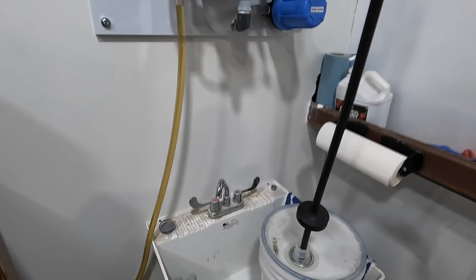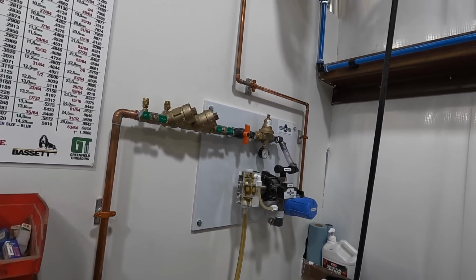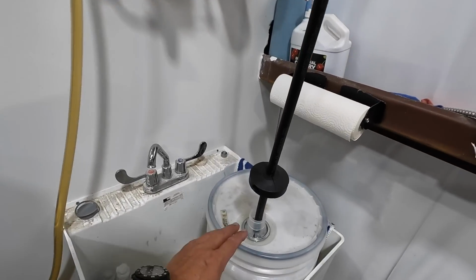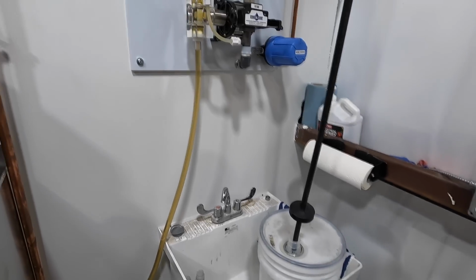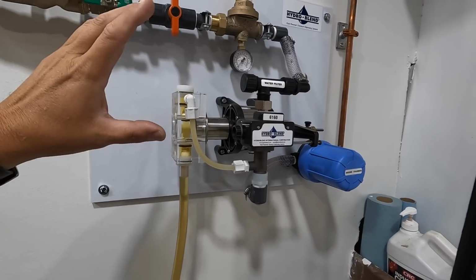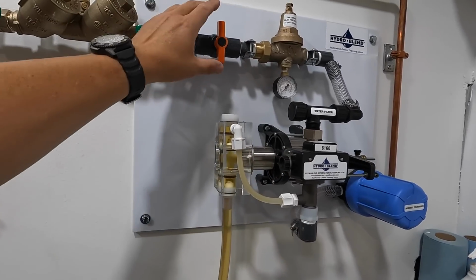And then I've got a refractometer that we're using to test it. What we're shooting for is right at a 10% mixture in the machine. But I'll go ahead and turn this on to show you. When you first turn it on, it's a little squeaky sounding, and usually you can just turn it off and then turn it back on, and it kind of gets away from that.